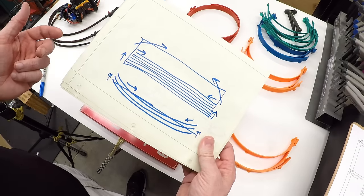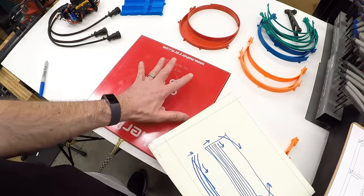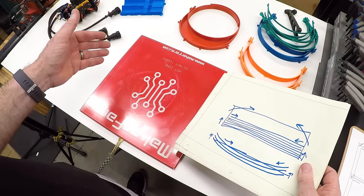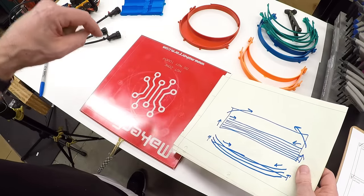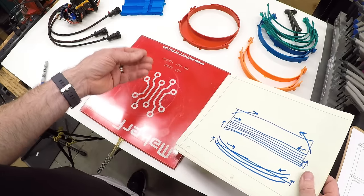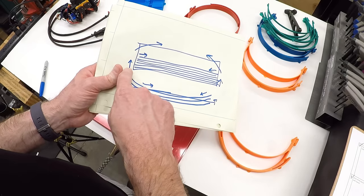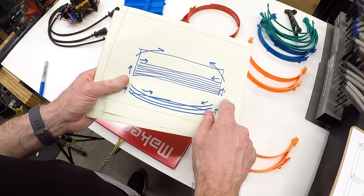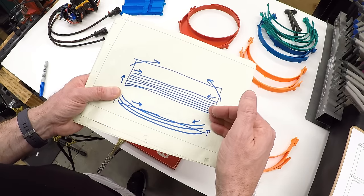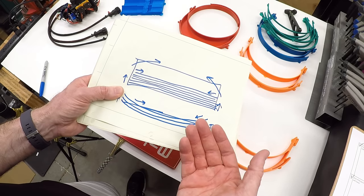The great way to do this is with a heated chamber. If you look at commercial industrial 3D printers, this is exactly how they do it. The whole print area and the head are in a chamber heated up to just below the freezing temperature of the plastic. It's melted and extruding out, then air movement rapidly cools it to just below the freezing point so it solidifies — but then holds it at that temperature. There's not necessarily even a heated bed on the bottom; the whole chamber is hot, it keeps the part warm and uniformly warm, so you get much less shrinking, which means you need less bed adhesion to get a successful print.